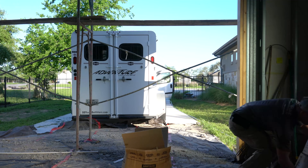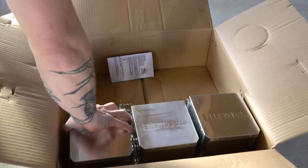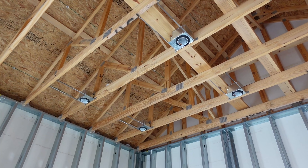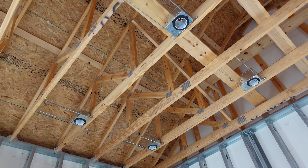When I arrived, I brought a bunch of four-inch cans with me. They make recessed cans in three-inch, four-inch, five-inch, and six-inch. I chose four-inch because this is such a small place — the rooms are going to be really small. Four-inch still puts out a lot of light depending on what kind of LED trims you use and how many lumens are being put out of each one. The trims we were getting were going to be adjustable, so we'd have a little bit of leeway on whatever they wanted.